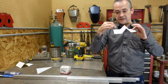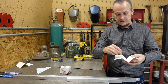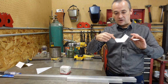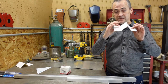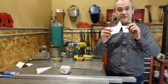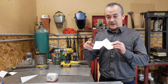You cut your frame out each little piece and put those together and use the corner brace so you've got a square took the aluminum L angle put it on the inside all the way around and you did that three times an 18 inch piece a 20 inch piece a 20 inch piece. This is where I built the entire piece but that was actually incorrect this is not one solid piece so I built it and put all four panels together.